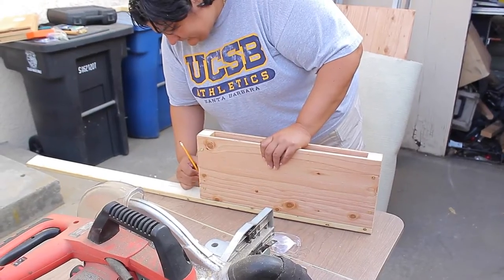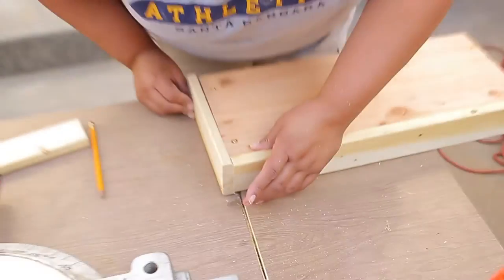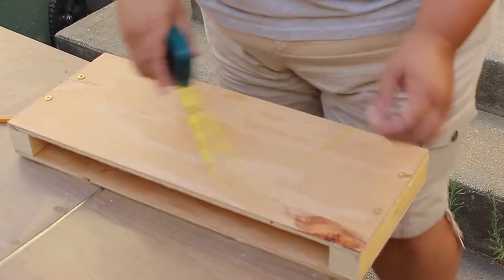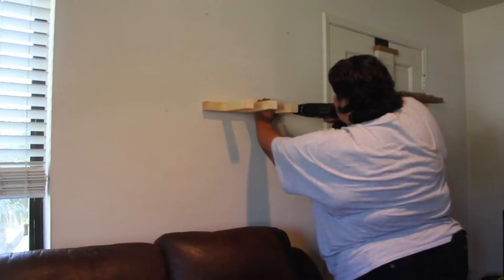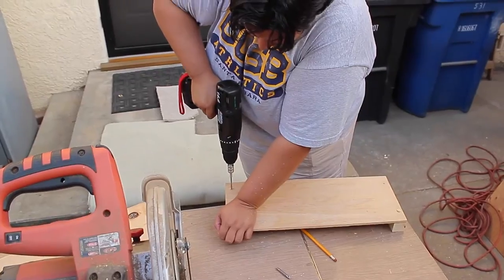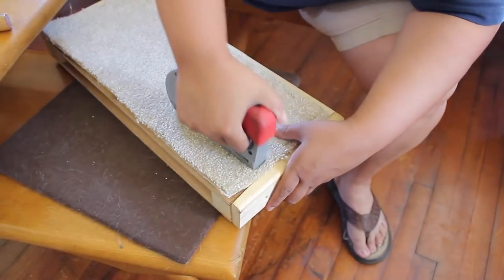And now for the finishing touches. Cut one-by-three boards to use as finishing panels around the front of the shelves. Cut the carpet to add to the top. Use a nail gun to secure the carpet. Attach the finished shelf to the cleat on the wall using screws and we're done. After getting through the first shelf, the rest were a lot easier. My confidence grew the more I worked. The first one is mostly done — waiting for the wood glue to set, then moving on to the next one.